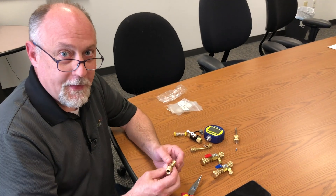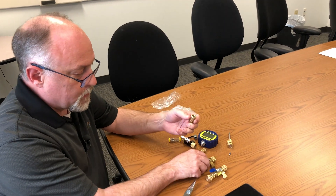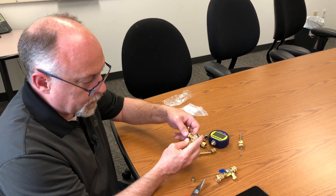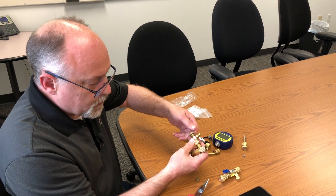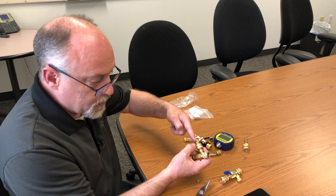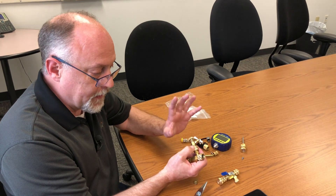But wait, there's more — I forgot I was going to talk about this in the video. Probably one of my favorite tools: this is called a valve core depressor. This is for when you can't get in and open a valve core all the way — like when an air conditioner is just too tight to pull out the valve core altogether. This is pretty common on Lennox units, which are really hard to get the valve cores out of. You thread this on, then drive it in and it drives that Schrader core fully open. It's a little plunger that pushes it all the way open, and then you get flow through the side port. It will open it substantially further than you can on your own — so that's going to make a big difference.